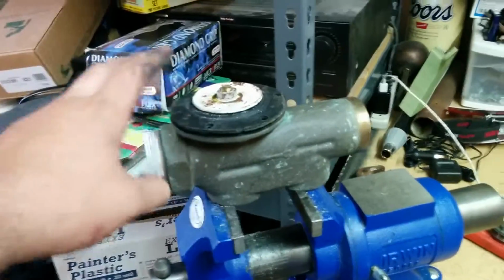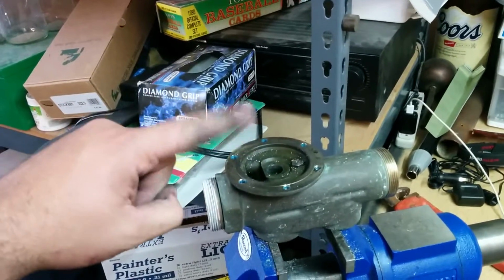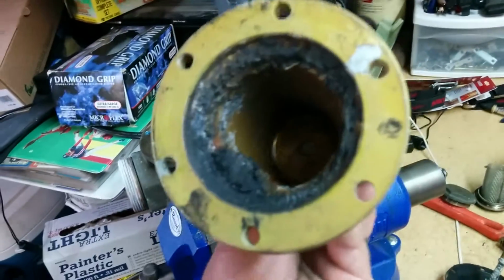And that has nothing to do with it. I mean, I can push it, but it's not going to do anything. So the seal is bad, the O-ring's bad, and that's when you start getting your issues. Bad O-ring, bad diaphragm, it's weak, it starts bouncing up and down in here, causing fluctuations. And you can see that's all caused by all this material corrosion.